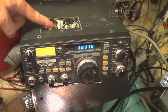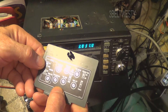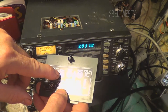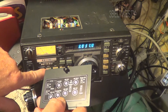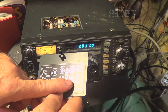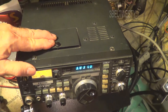The hidden panel also has an adjustment for the loudness of the side tone in CW, and a bunch of other little things. It's got the marker frequency if there's a marker. The CW monitor controls how loud the CW side tone is — what you hear out of your own speaker when transmitting. You've got the narrow and wide filter, the VOX delay, which controls how long it takes to go from transmit to receive when using VOX. There's a speech processor on/off, and you can set the meter to read SWR or power output.